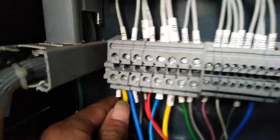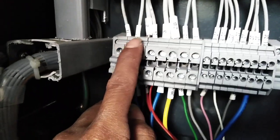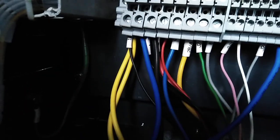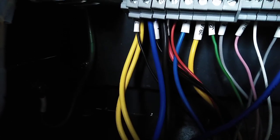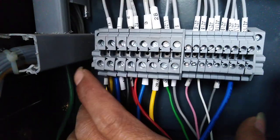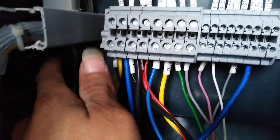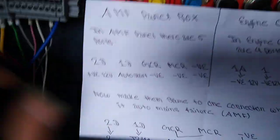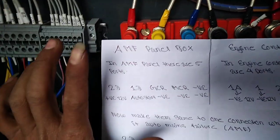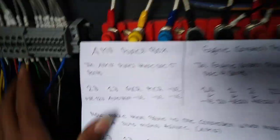First you should look here — here are ports 1A, 1, 2, and J2/11. This is the genset auto start port. Here I have joined two wires: one blue, then one black, then also one blue. These 5 wires come from the AMF panel box. In the AMF panel box there are five ports: 2D, 1D, GCR, MCR, and negative.